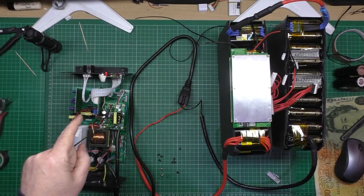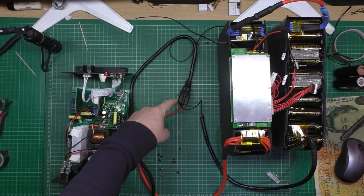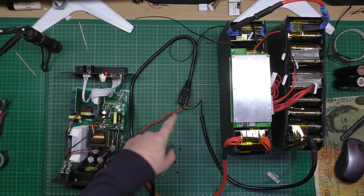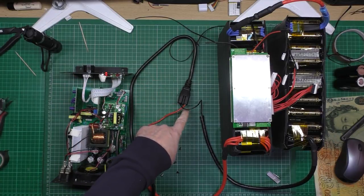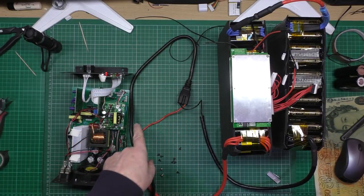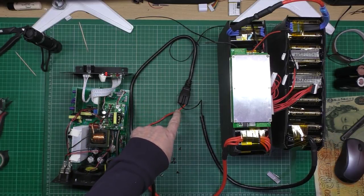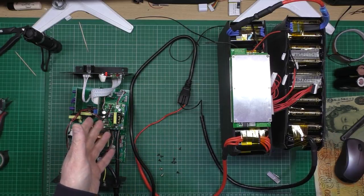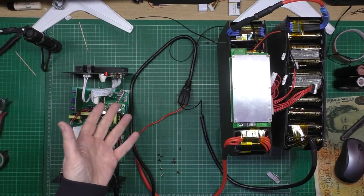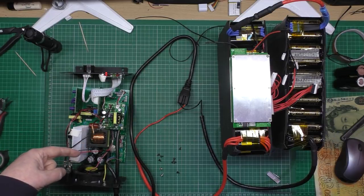Anyway, what I tried to do, I took it all apart, because out of here I'm only getting 1.8 volts. It fluctuates between 1.8 and 5 volts. So, it's labelled on there, live neutral. Even in the instructions, it says live neutral. Anyway, I checked it. That's live and that's neutral with no load, nothing plugged into it. Obviously, this is the battery plugged in at the minute. It's exactly how it should be when you switch it on, but you don't get any voltage out whatsoever.